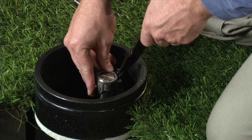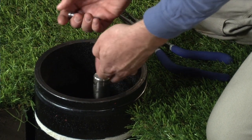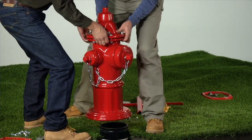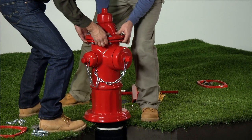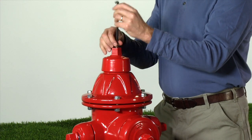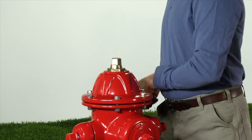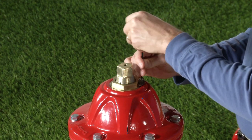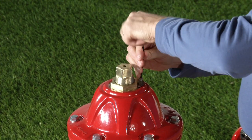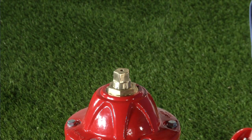Remove and discard the broken breakable stem coupling pieces. Place the nozzle section on the lower barrel to facilitate removing the upper stem. Remove the weather shield retaining bolt with the 5/16th or 8mm hexagon key and lift off the weather shield. Remove the lock plate retaining screw and the lock plate with the 7/64ths or 3mm hexagon key. Older hydrants may be equipped with a set screw instead of a lock plate; remove the set screw and set aside for later use.